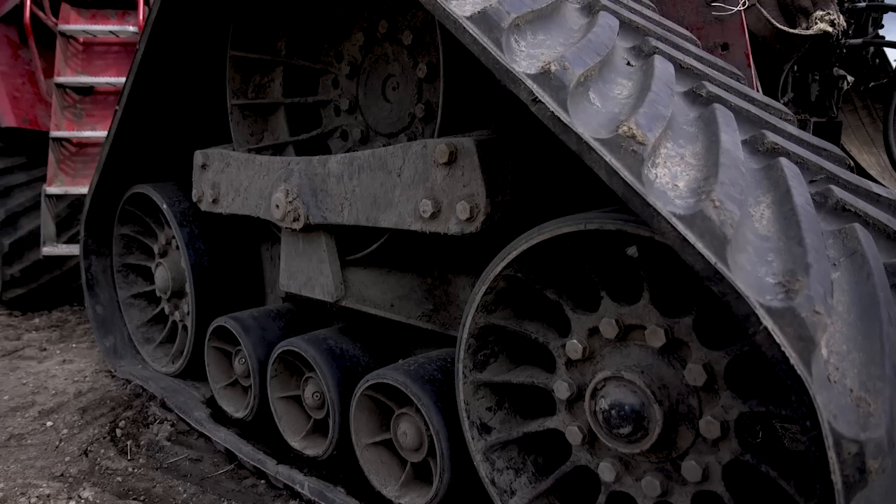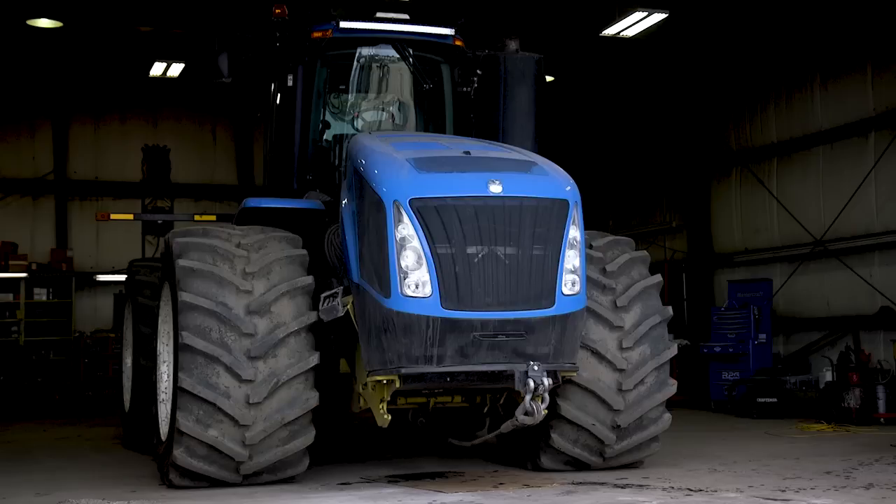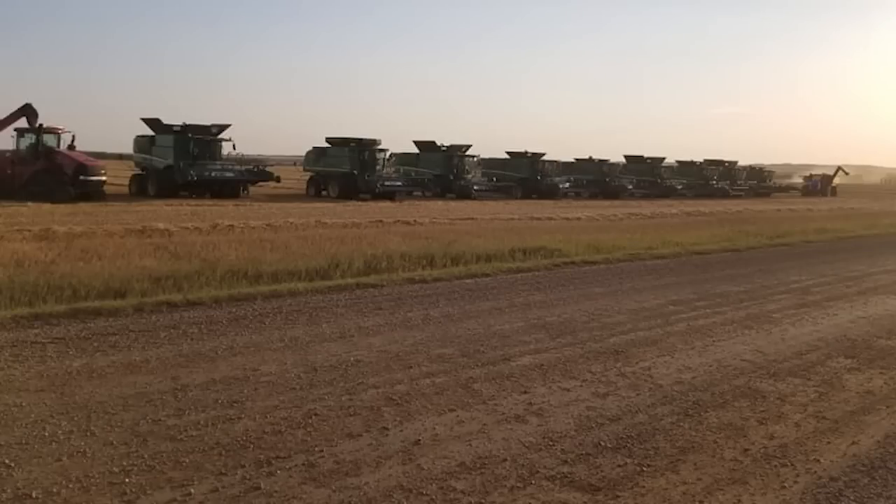Some of our land you're getting larger fields further away, so you need a faster tractor to get there. The difference for us was 17 miles an hour with the tracks — now we're 25 miles an hour with these tires. The LSW tire is way smoother; you can go 25 miles an hour and get to the field way faster, which is better because on the grain cart the combines are already full and the tractor's just arriving. On a 20-mile drive to a different field you're gaining a half hour. If you do 30–32 acres an hour, you're in the field a half hour sooner, so over the course of a month that'd be 450-plus acres gained versus the tracks — on one machine alone. Out of six, that's going to be a big difference.